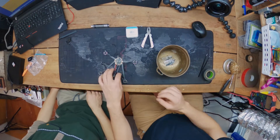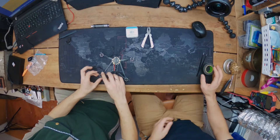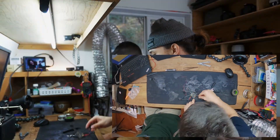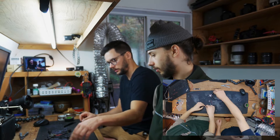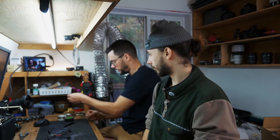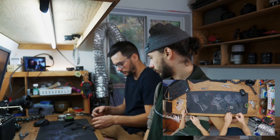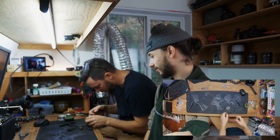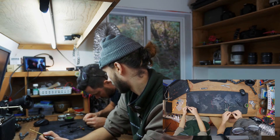The next thing is to figure out your motor wire length, run them up, then chop all those guys. After that, pre-tin all the wires. Strip them and then tin them. The solder boy is on motors today - the super small ones. Just don't do it over top of the flight controller.